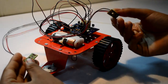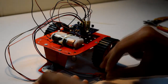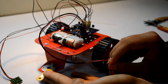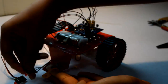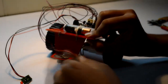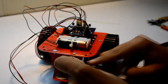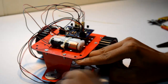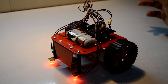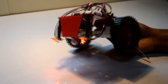Coming to the sensors — especially the placement of the sensors — we will give you two options. Option one: take a metal bracket like this, attach it to the two holes over here, and you can simply slot the sensor over here — left one over here and right one over here. The second option is to flip the whole chassis and take spacers of 4.5 cm or 45 mm, and elevate the sensor from the top down to the bottom. I have tied all the long cables with the help of cable ties, and this is the way I was talking about for connecting the sensors.